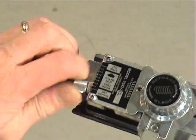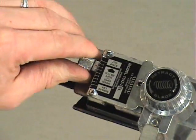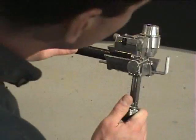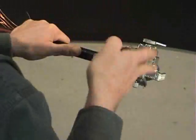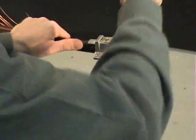Set the blade cutting angle to the width of spiral you desire — approximately one quarter inch is ideal. As a general rule, harder insulation materials require a smaller spiral than softer ones. Spiral the tool down the cable until the conductor hits the scale gauge. The tool automatically squares off the cut when using the scale gauge accessory.